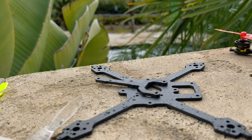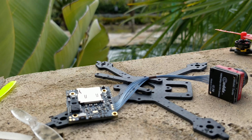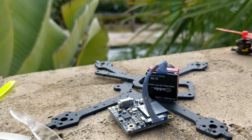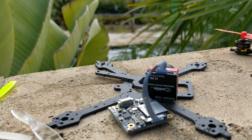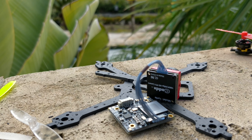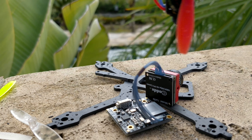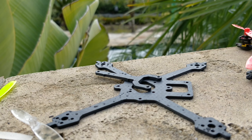The last frontier for this kind of a build is to finally cram the split camera on there. I have a dozen designs to try and fit it and none of them are up to my standards — it just doesn't fit nicely with the boards. The only reason I'm even considering it now is that once I flew it with a 900 milliamp battery at 88 grams all-up weight with 1103 motors, I realized this thing is awesome even up to 90 grams. So let's put the split on there — I can get it below 90 grams with a 450 milliamp battery. My original idea was to have two cameras: the split as well as the tiny micro cam, but that's just too small a platform.